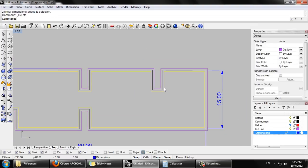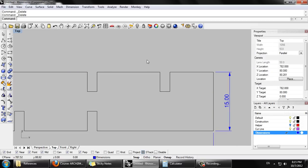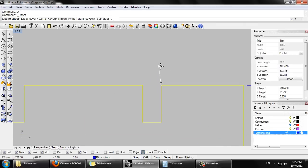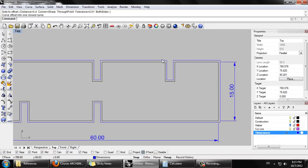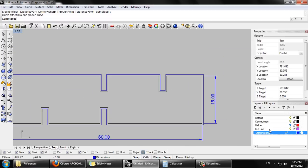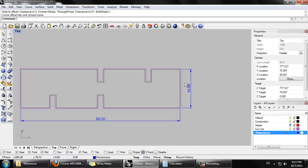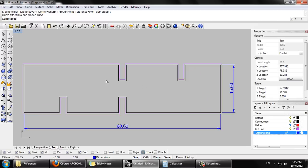This is easily done. We take our final polyline border and offset by 0.4, which is equal to half of the width of the laser. If we cut this line, we'll end up with the correct result. Basically, the only thing we need to do is once we've drawn our 2D geometry, offset to the outside by half the width of the laser — which should be 0.4 for a material thickness of 2.4 — but this is something you'll need to investigate on your own.